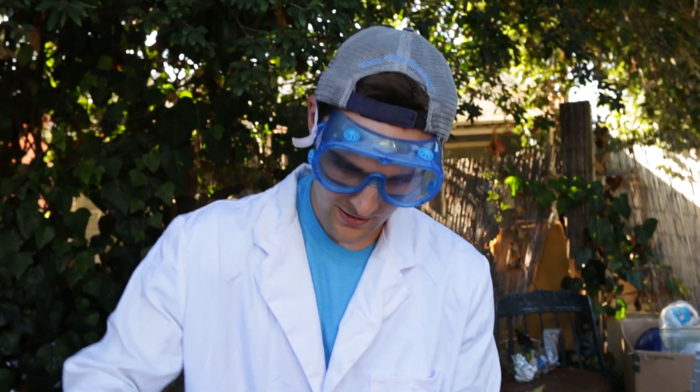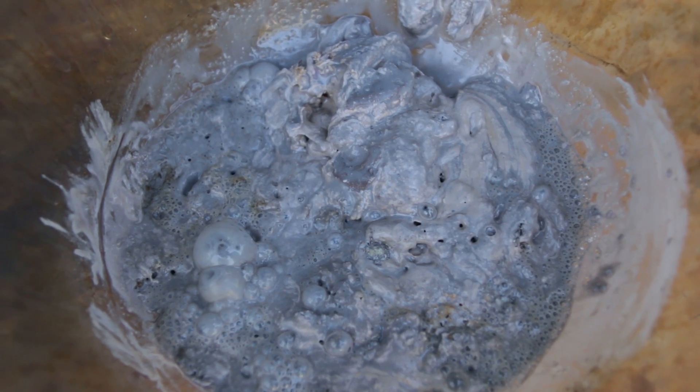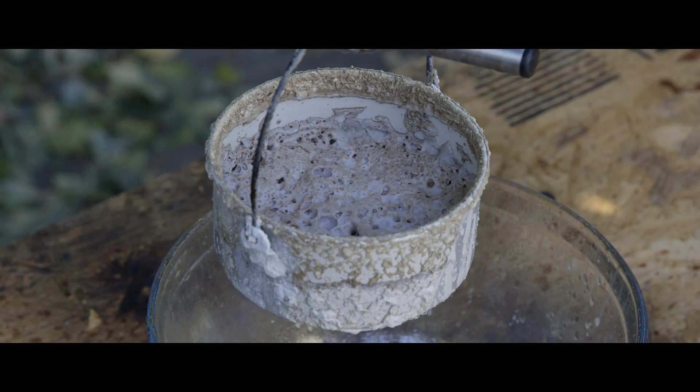That reaction is extremely exothermic. So myth confirmed - online rumor confirmed. If you put sodium hydroxide, or lye dissolved into water, inside of an aluminum pot, it really will eat right through the bottom of it. We obviously used a lot - 500 milliliters of as much sodium hydroxide as we could dissolve in the water. Even if you use a little bit less and gave it more time, it would probably still eat through. Do not mix sodium hydroxide with an aluminum pot - it'll eat right through the bottom. If you liked this video, give us a thumbs up, let me know if you were surprised how aggressive the sodium hydroxide was, hit that subscribe button and we'll see you really soon.